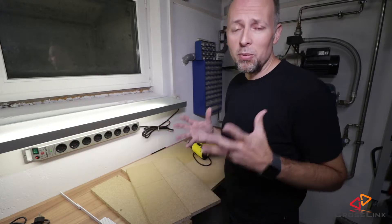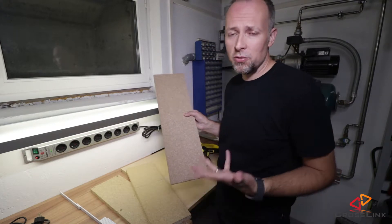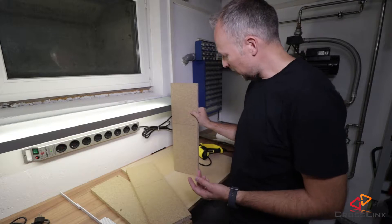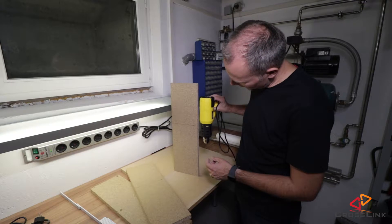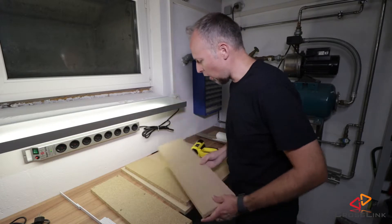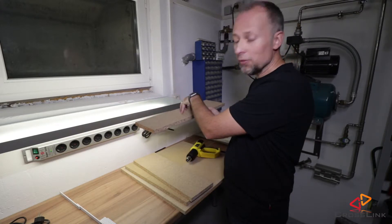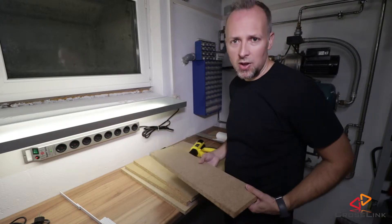Step one: we are going to cut these two pieces of chipboard. I measured a distance of 32 cm, which would be fine for me. So at a height of 32 cm we will have the heat gun mounted. The heat gun is going to come through a hole in the top plate, which is going to be mounted at around this height, with a hole in the middle.